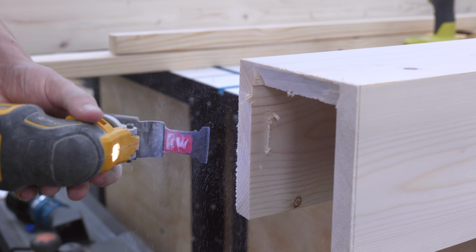The main reason for it is I'm hoping it's going to give a little bit of moisture protection in case, I don't know, you're mopping the floor or something and water ends up near the bottom of the baseboard. I want the bottom to be sealed as well as possible. So, just been spraying pretty thick, right on the edge here, and just wiping the excess off the top.